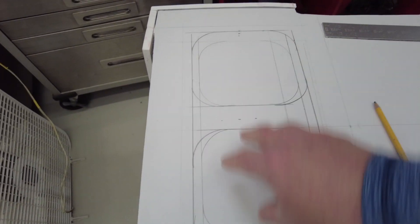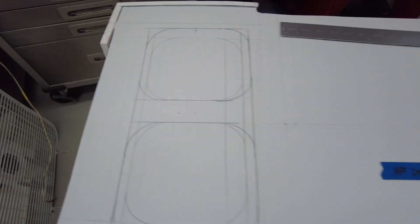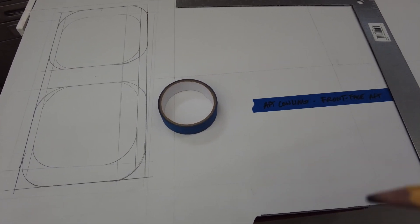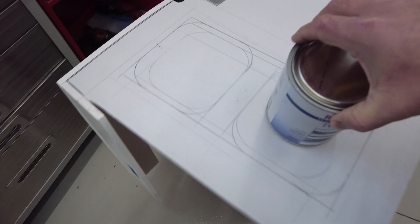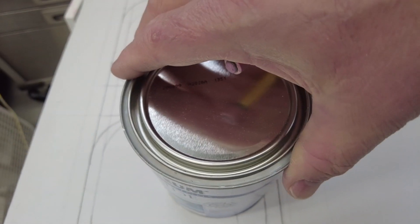Cubby holes and stretch netting — it's awesome. This is a two-inch piece in there, so it's two cutouts but one box behind it with a shelf in between, and we'll do one on each side. Now to make the radius in the corner, I always use something I have handy — it doesn't really matter what you use as long as it's the same thing for every one of the radiuses on a particular project. I'll use a roll of tape or even the radius of a can of paint. That way I know it's the same every single time — just line it up, draw your radius, and cut it with a jigsaw.